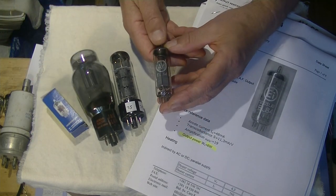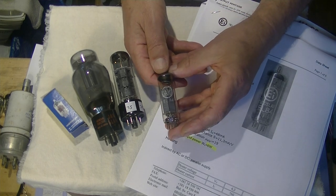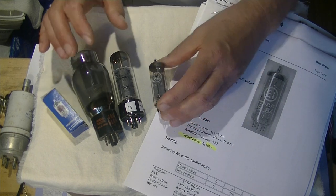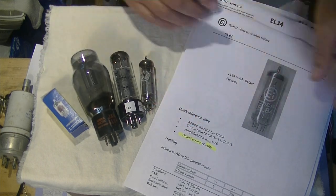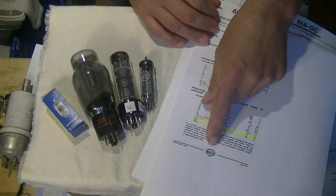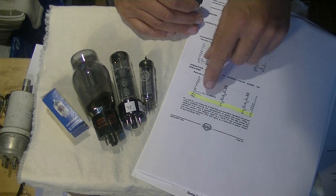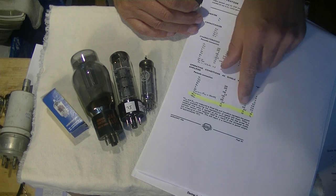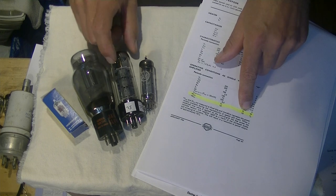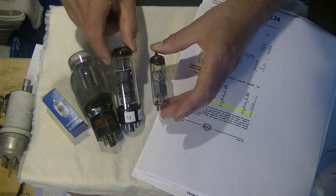But if we wanted a lot more power, rather than build an amplifier with lots of EL84s, we'd probably use a tube that meets closer to our specifications — perhaps one of these. Here's the spec sheet. This is a Mullard. I don't have an EL34 Mullard to show you — they're very expensive. But here we have a single-ended operation of 11 watts. 6 watts versus 11 — almost twice as much power, but you can see it takes a much bigger tube.